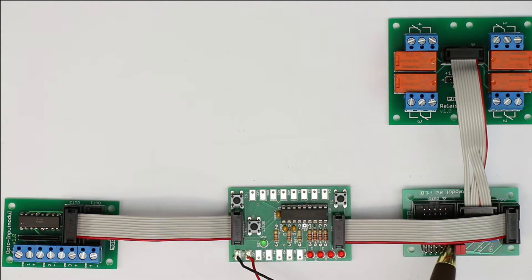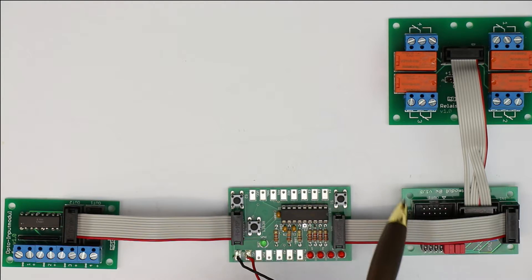The first PCB is an eight-port Darlington driver chip, the venerable ULN2803A. It can drive up to 500 milliamps maximum, but not for all eight channels simultaneously — the 500 milliamp current limitation is the total for all outputs combined. You can and must provide an external voltage, designated here as plus 12V, but it doesn't have to be 12V. Anything between 5V and 50V is acceptable.